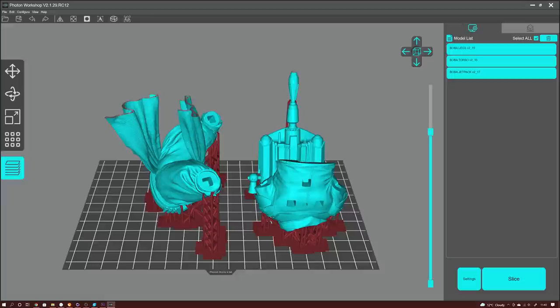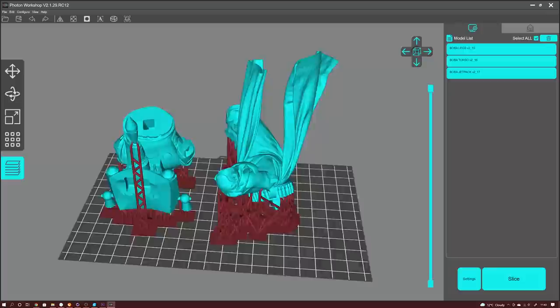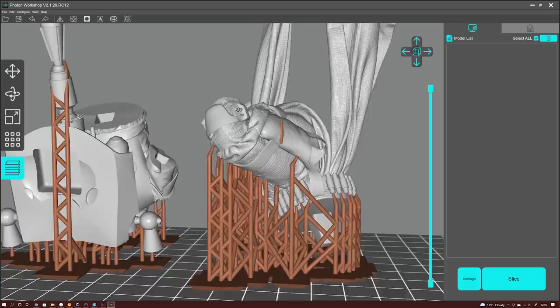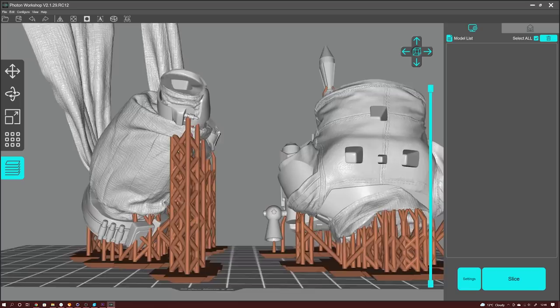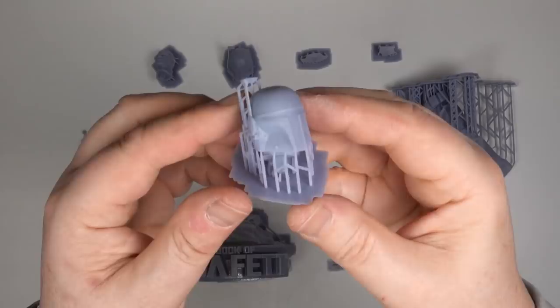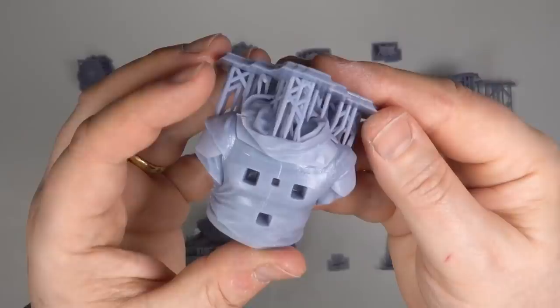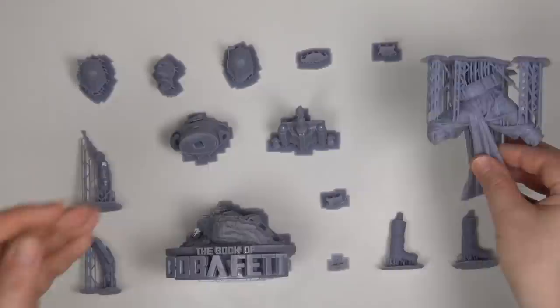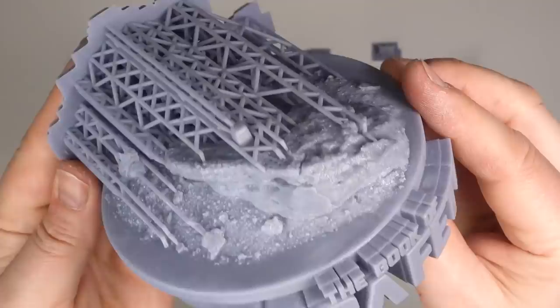The Anycubic 6K is a fantastic machine perfect for my needs, but its slicer software does let it down. While it functions like most others and allows you to do all the standard stuff to configure your parts for printing, it does have one very annoying feature: if you save a project and then reopen it to make changes, you can find the support structure has shifted away from the part, and the only way of recovering this is to start over again. Other slicer software is available such as ChituBox and Lychee, both of which are compatible and just as easy to use. After a few days of printing, the detail is amazing — layer lines are really hard to find and all the edges are super crisp. I'm so glad I got this printer and I just hope it'll give me the same results with my wings.